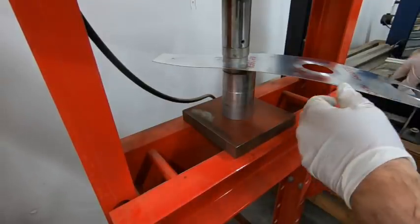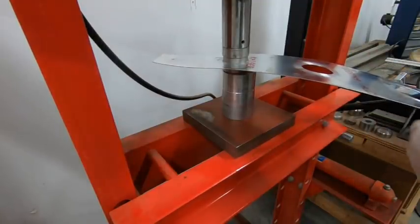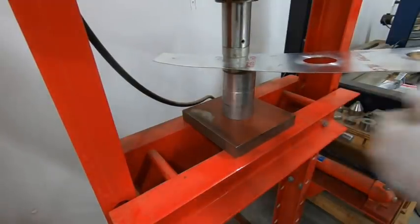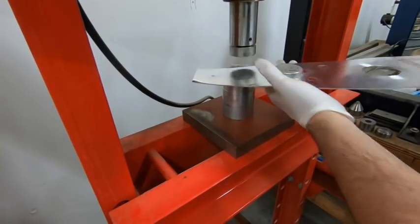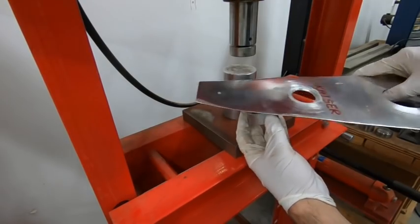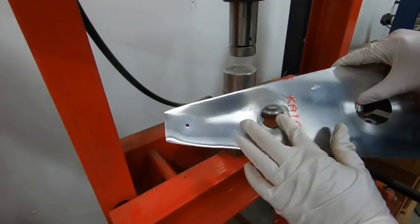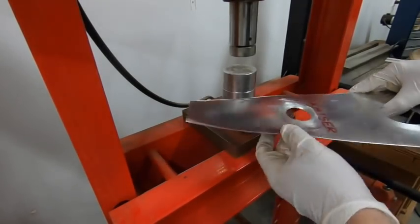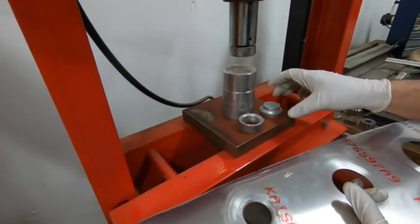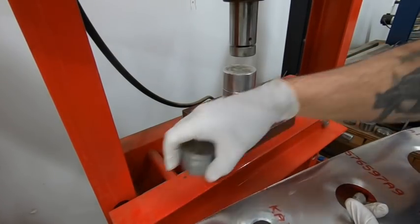You want to load it up pretty good. Now it's just starting to show on the gauge, and then back it off. As long as those dies stay nice and clean, it'll be okay. There we go — got a nice little flange on that guy. I'll move on to the next size, which is a 2-inch for this one. I'll put this set back together and just carry on.